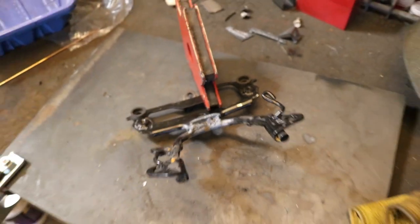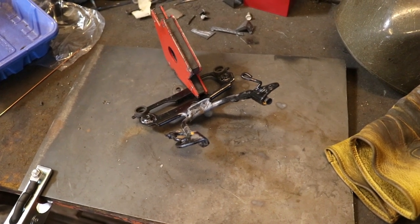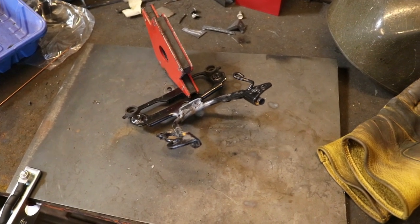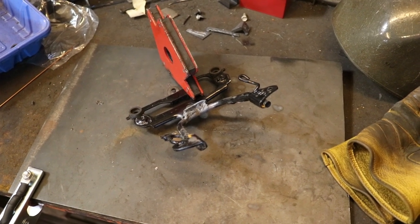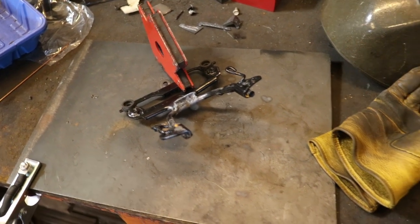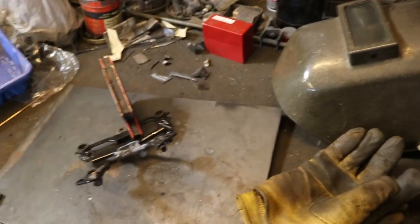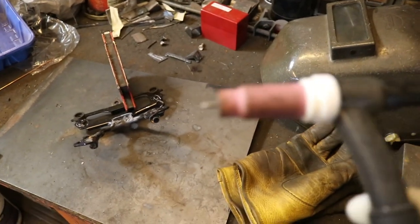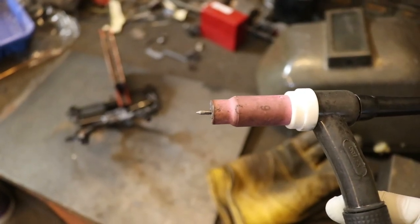I watched a video the other day by this guy, This Old Tony, who does a lot of welding tips and tricks on his channel apparently. He had a video on puddle control, and I'll link that in this video here because it was actually pretty useful. I also had a friend stop by the other day and give me some tips as well, as far as making sure my stick out on the torch is right. I shortened that. I had about half an inch, and I've got a little bit shorter than that now. It's closer to a quarter inch.